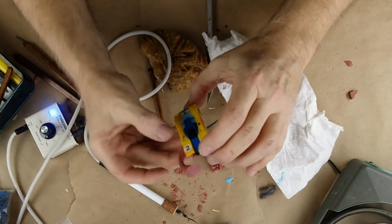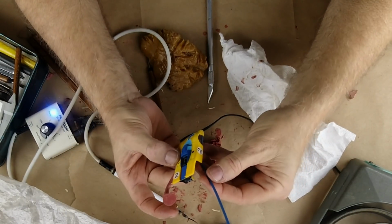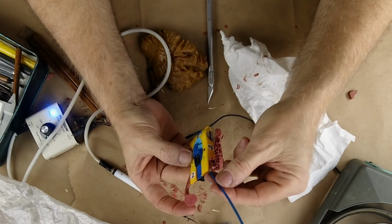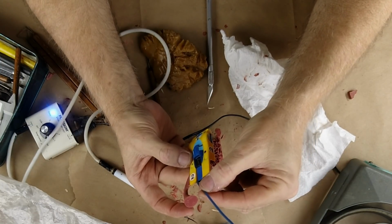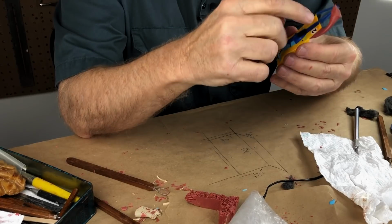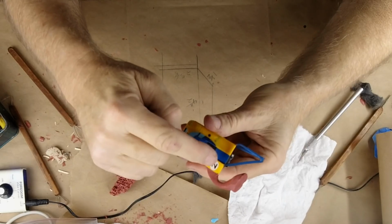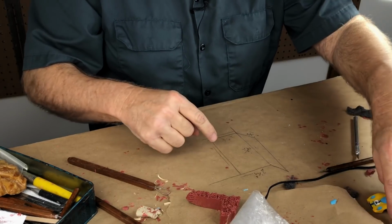You get the idea. Now the other thing I'm going to do, I'm going to put a vent off of here like that, a vent off of here, and a vent off of here. No getting around it. You need each and every one of those vents. And I will do that next. I got this funnel and the sprue mounted, and I also mounted 3 vents, as you can see here. I also calculated the size needed for our box size. So let's go out and cut the pieces.